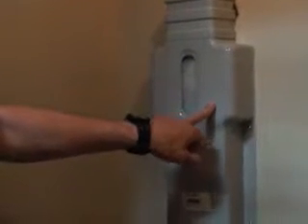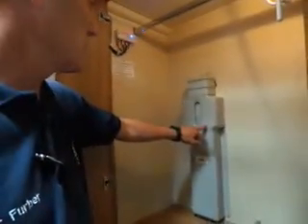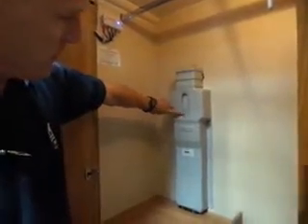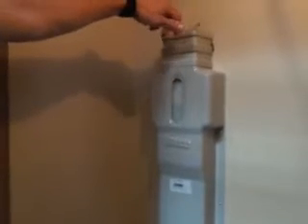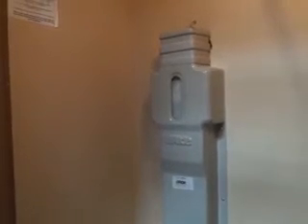This is your expansion tank for the heating system. The fluid circulating around the van is separate from the hot tap water — it's an antifreeze mix. Before you start, when it's cold, make sure the level is a finger's width above the minimum mark. As it warms up it will expand. If you need to top it up, use the correct antifreeze mix — one customer put the wrong fluid in, it went very thick and the whole system had to be flushed out, which was expensive. You can get it ready-mixed from us. If you're on site and need a temporary top-up, water is okay, but make sure you add the antifreeze properly afterwards, especially in winter.